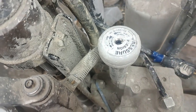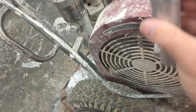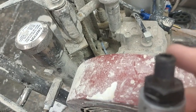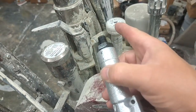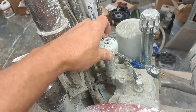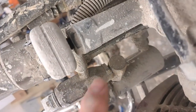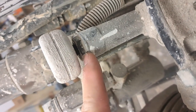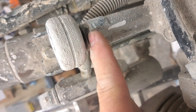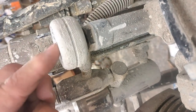Once you've done that, you're going to have on the underside of this — and this is a brand new one here, so this is the piece here without the cap. The best thing to do is remove the silver cap as well. So take the set screw out and you're going to take that cap off. You're going to take this knob and turn the pressure all the way down as far as it will go. Underneath here you've got this hex nut shape. You're going to stick a wrench on here and put a pair of vice grips on here to unscrew this. And it's going to be hard — it is not going to come off easily.